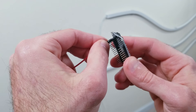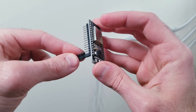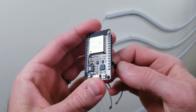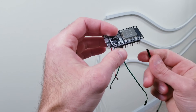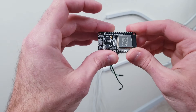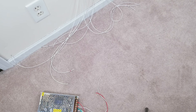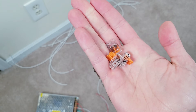I'm going to take my red jumper wire and plug it into the VIN pin on the module. Next I'll take the white one and insert it into the GND pin right next to it. I'm going to plug one green jumper wire into the D2 pin, another into the D4 pin, and a third into the D5 pin. The total of just under 600 LEDs would run fine on one pin, but I wanted to try something different this time. To connect all the wires together I'll use a couple of five-slot WAGO pieces and three two-slot pieces.